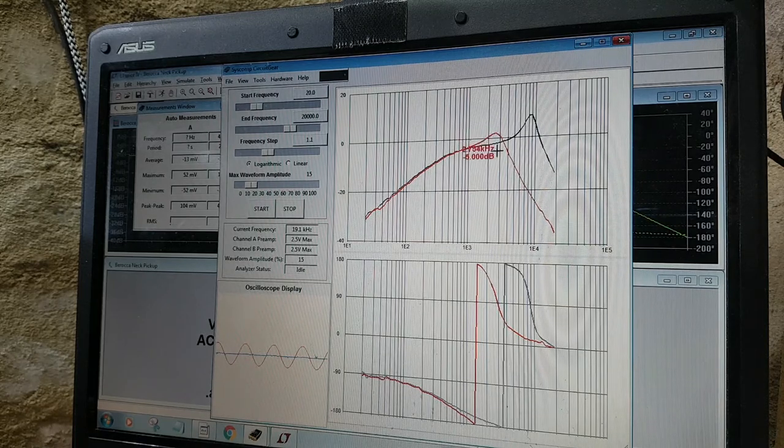So now I just have to measure the pot resistance and then do my maths on its parallel resistance with the 1 meg scope impedance. It's remarkable, really, just adding a cap and a resistor, and you get a completely different treble characteristic to the pickup.